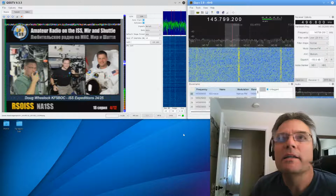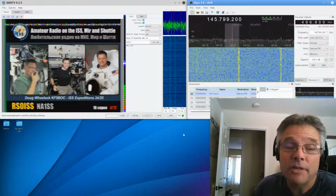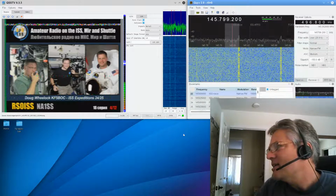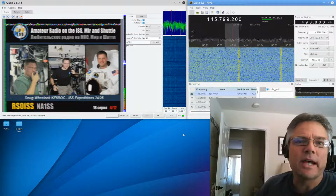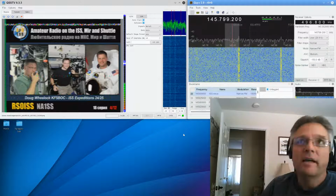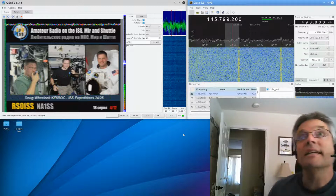If you're going to get into QSSTV or slow scan television, and you have an HF radio, check out 14.230. That's the calling frequency for slow scan television, and you can use your HF radio and tell QSSTV to listen to your HF radio, and you'll decode and send images.